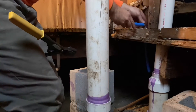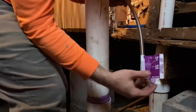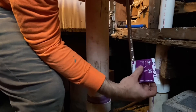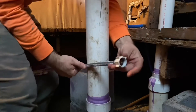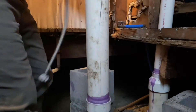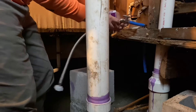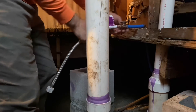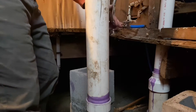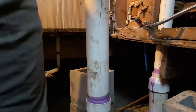That goes through the floor and this side's done. I'm going to show you what this does though - there's a 20-inch toilet supply line, 7/8-inch to 3/8-inch, and it says 'toilet' on there with a picture of a toilet. One end is big with a plastic end and the other end is metal. This metal end replaces the piece I just threw away. This end goes on here and you'll want to use Teflon tape. This side connects to your toilet tank.